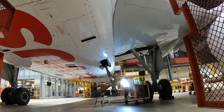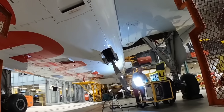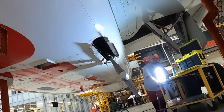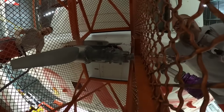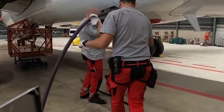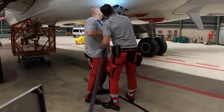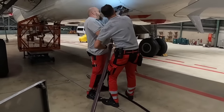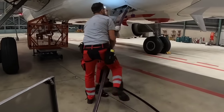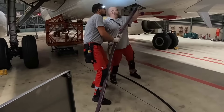And let's go back to the test. Safety is always a priority, so the next step is installation of the protection cage. Once the cage is in place we can proceed with installation of the flow controller. It must be connected to the pressure and return line of the blue hydraulic ground connection. This way we will have direct access to the pressure produced by the RAM Air Turbine during the test.